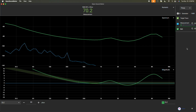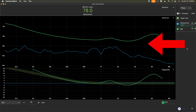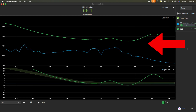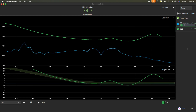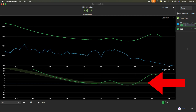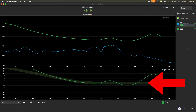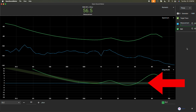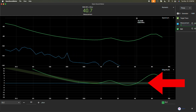Make a note of that gain setting and don't change it. The middle chart is a spectrum reading showing you what is being heard by the reference mic across the entire frequency range. The bottom chart is a magnitude reading which compares the pure signal going to the speakers with what's actually being heard in the room. For this to work, configure your measurement inputs correctly — the M input should be the reference mic and the R input should be your main mix. Let me show you what this looks like on Sundays at my church.